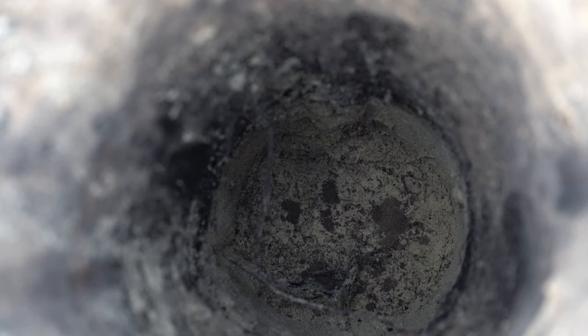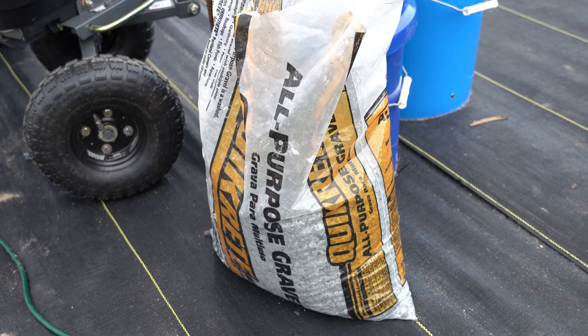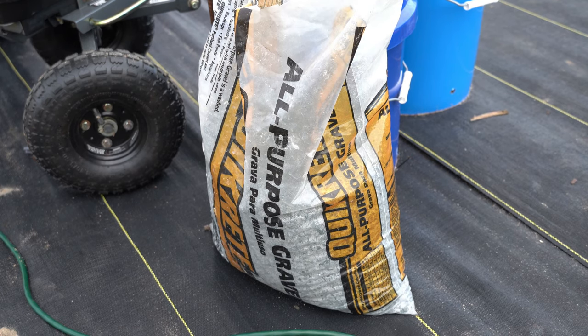Although I'm only burying my posts 36 inches deep, I actually dug all my holes to 40 inches. That is because the bottom 4 inches of all of my holes are going to be filled with 4 inches of Quikrete all-purpose gravel. The reason why is I don't want the bases of my posts contacting pure ground — I want them to sit up above it because even though my soil has fantastic drainage, the ground will stay damp to some degree. That gravel buffer will keep my posts off the damp ground, prevent rot, and give them a really firm base to sit on.